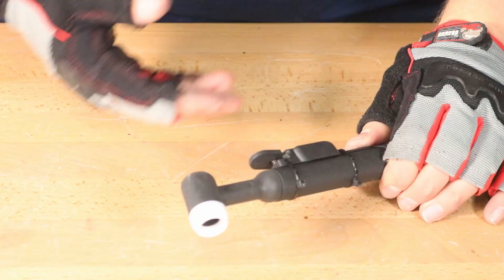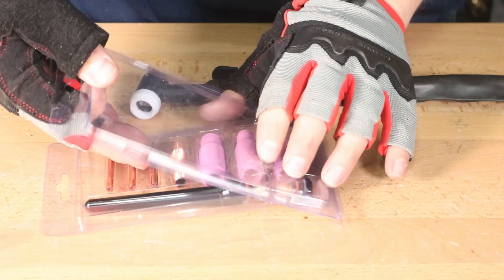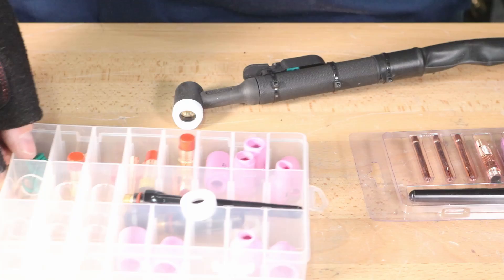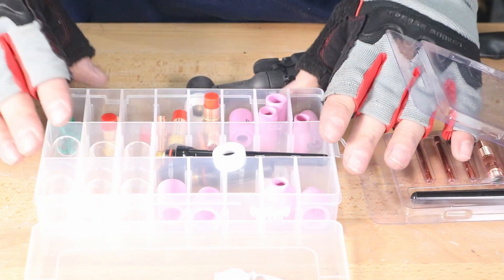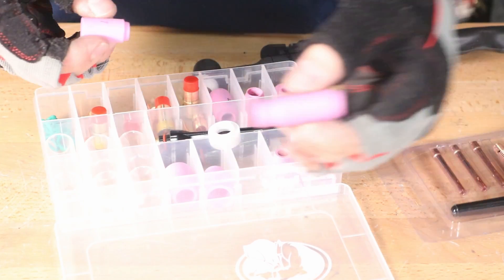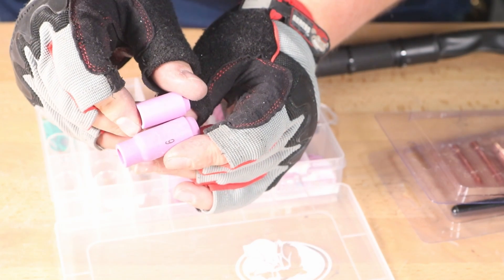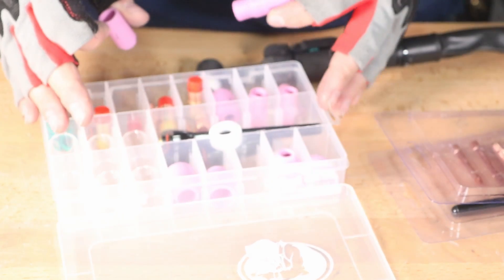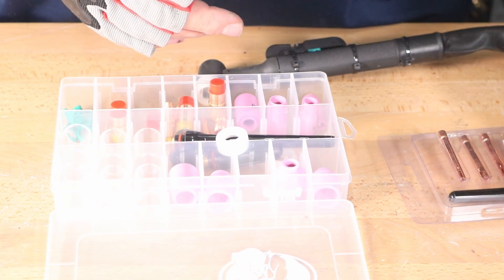Okay, now I need to go ahead and assemble the torch. These are the consumables that came with it and they will definitely be adequate for the job. However, YesWelder sent me this consumable kit that has stubby consumables. What I mean by stubby consumables is if you look at the length of the original cup and you look at the length of this cup here, you can see it's about a whole inch shorter, and this makes things a lot easier to use. So I'm going to go ahead and assemble it with this kit that they sent, and I'll put a link below because I think that's a really good upgrade — it'll help you quite a bit.